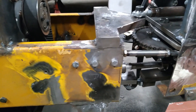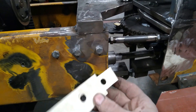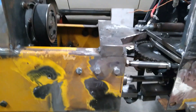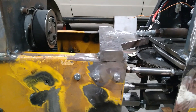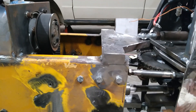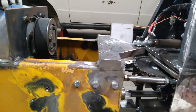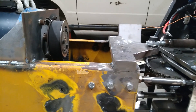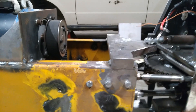I used the same trick for a link bracket that was sitting a bit too high — put the bracket on a piece of paper, hit it with the ball-peen hammer where the holes are, and then put it right there. You end up with holes in the perfect spot every single time. If you have a nice circle, center-punch the hole, start with an eighth-inch drill, make sure it's really close to center, then step up to a slightly larger bit and move the drill as needed to stay centered on the circle.